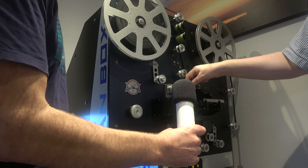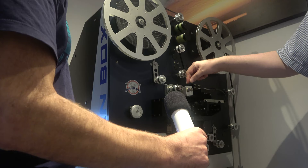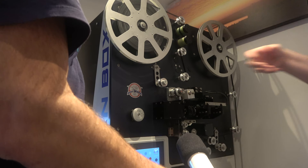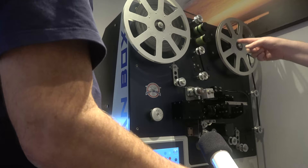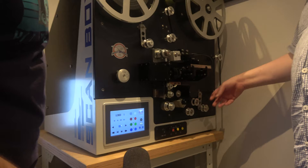That's the head there, to make sure you've got the right 8mm, super 8mm, 16mm or 9.5mm. It houses a little laser which fires at the sprockets, so it knows exactly what frame and where the frame should be. In front of the camera is the capstan — there's no gearing on this at all, there's no claw. So if the sprockets are ripped off, it'll still go through fine. That's a little rubber capstan which keeps the film feeding around to another tension arm, and finally onto its final resting place.